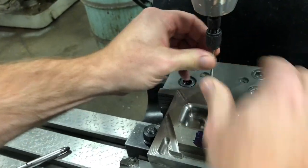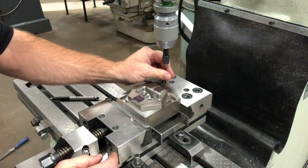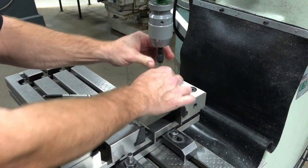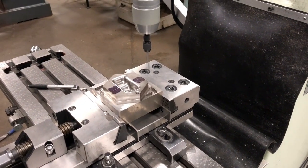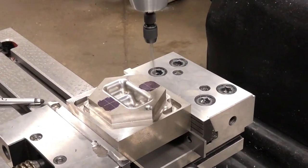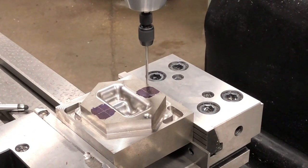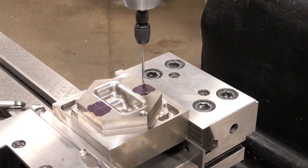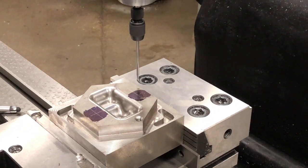This is a pop-in style where you pop it in and tighten it up. The amount of tightness on here will depend on the amount of freedom you want the wiggler to have — you want to be about medium tight, still with some ability to move. Turning this on to a thousand again. My wiggler is out, and as I move in it'll start to touch. Now this disc is 100 thou, so when I get to zero, I lift it up, move over 50 thou, and re-zero my indicator.